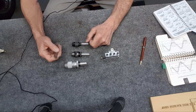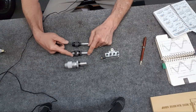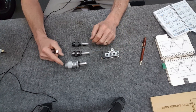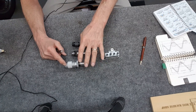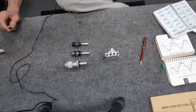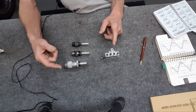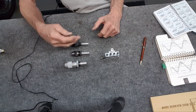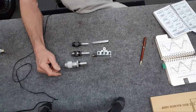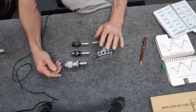You guys saw in the video making, I forgot which arbor, probably this one, under the stereoscope, the threads were just gorgeous. And also the dial indicator on these threads showed less than a thou worth of bounce, and that was probably more just the rough edges on the threads, because I never put Scotch-Brite or a file or did anything to clean them up. This tool I haven't shown being used, but I guess you can see it in the new intro, and it's really nice.